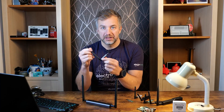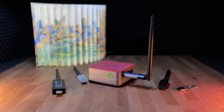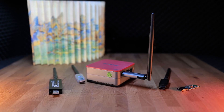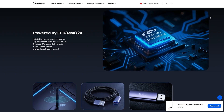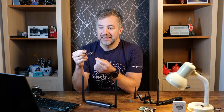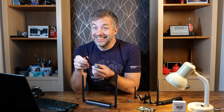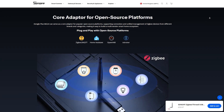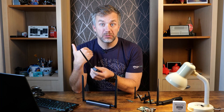Let's start with the tiny one, the USB version — this is the Sonoff Dongle MG24. MG24 stands for the new microcontroller and radio inside, which is the EFR32 MG24, capable of Zigbee 3.0 and Thread, so we have Matter support. This can act as a coordinator or router, depending on how you want to use it. ITEAD claims it is compatible out of the box with Home Assistant and Zigbee2MQTT, which I'm using in Node-RED. We'll be testing that.